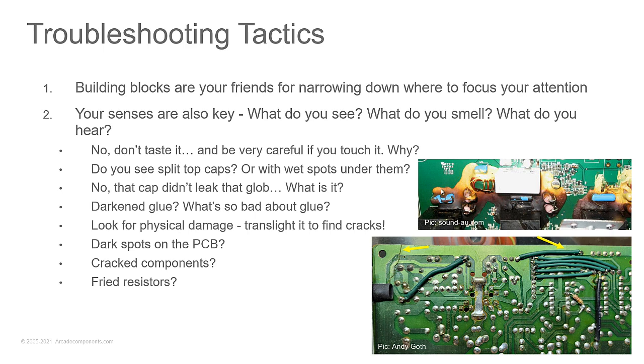Now, I actually have repaired a few different arcade game boards over the years where somebody actually soldered a staple to the board and had it running out to the edge connector to be a replacement for a lifted edge connector pad. Yeah, when it left my shop, it was repaired properly.